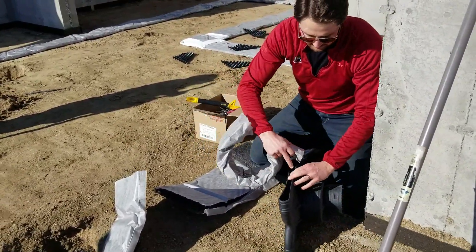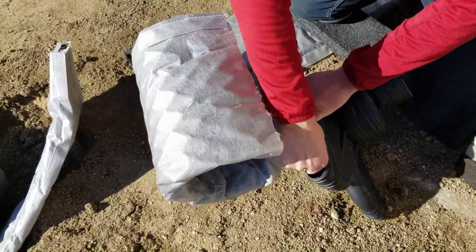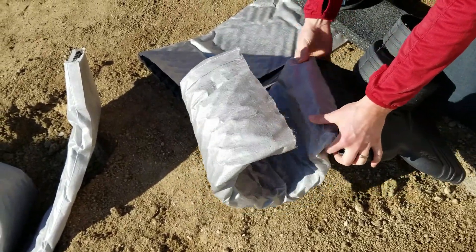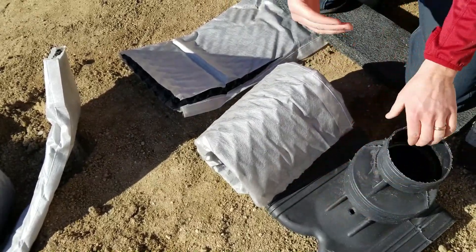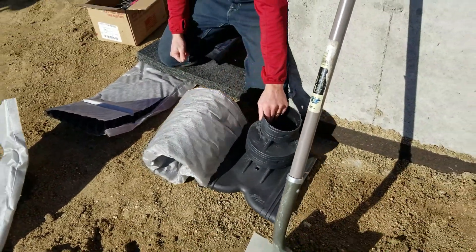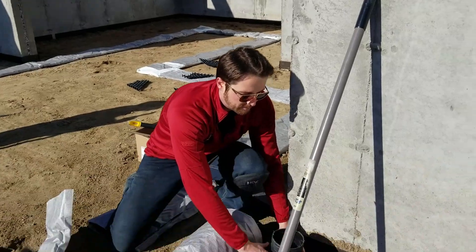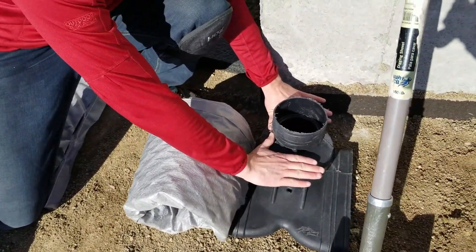With your T-riser, the mat conveniently slides right in, and then you have to tape it really well. We're going to put it in there and tape it, and eventually we'll take the one-foot steel spike and strike it through the T-riser once we've got mat going out both sides. In this home, once the slab is completely poured, all that will be showing is the top for the 4-inch Schedule 40 pipe — that's how high the slab is going to go.